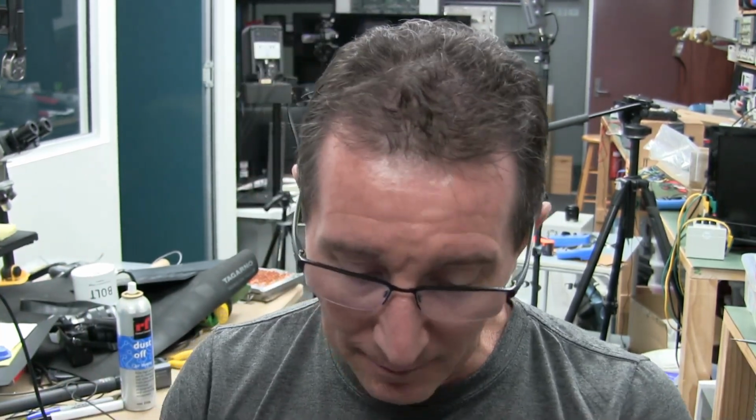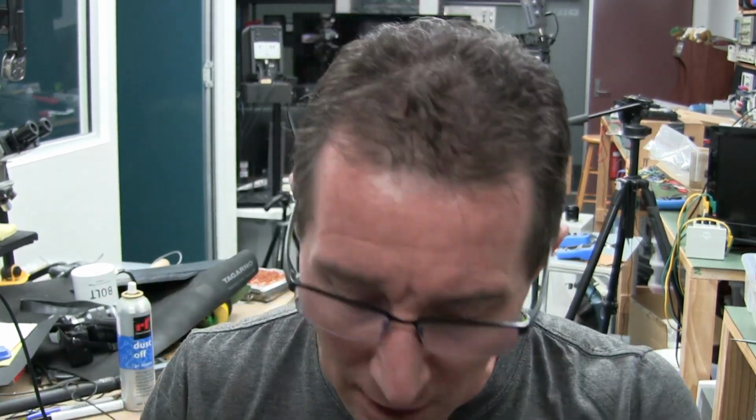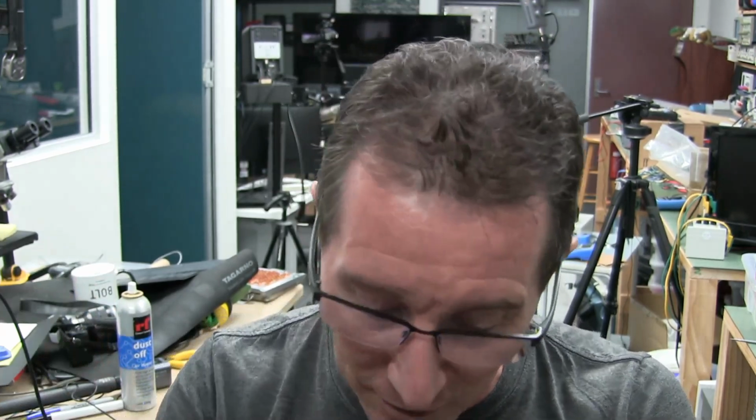So that indicates a switch fault in the multimeter, because a lot of a multimeter's functionality comes from the switch. It does an awful lot of stuff. The mechanical contacts can get dirty, they can lose their springiness. There could be some issue with the spring at manufacture, and they're complex little mechanical doodads, and they're not easy to get right. Switches. So if something's playing up with your multimeter, take it apart, take apart the switch contacts, have a look, maybe clean up the contacts. Have a look at the springs under a microscope or something, and see that everything's kosher, that there's good downward pressure on them and all that sort of jazz.